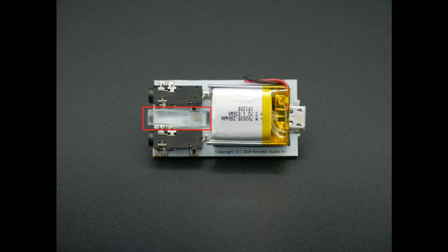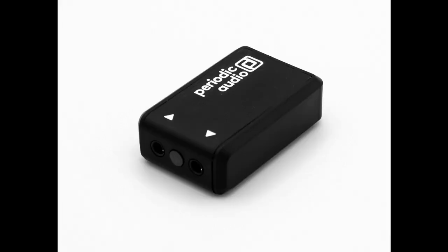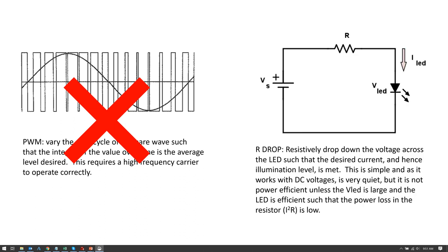The LEDs are green, yellow, and red for battery level — green when full, yellow at halfway, red when dangerously low. It's dark when off, lit when running, and flashes when charging. We don't use pulse-width modulation to set the intensity level, because that can generate noise in the audio circuit. Instead, each LED has its own bias resistor for consistent illumination across all three colors.